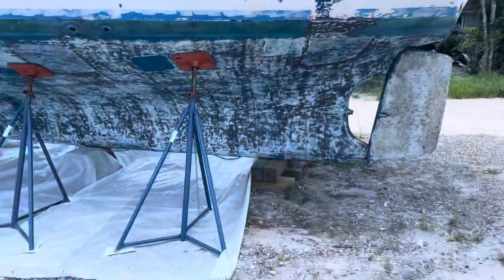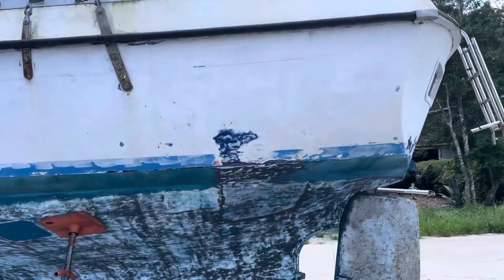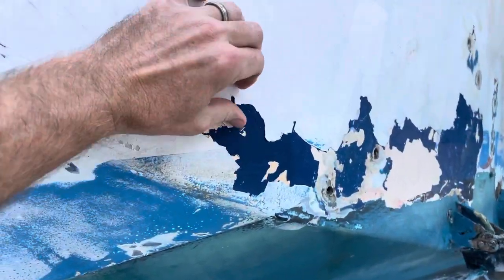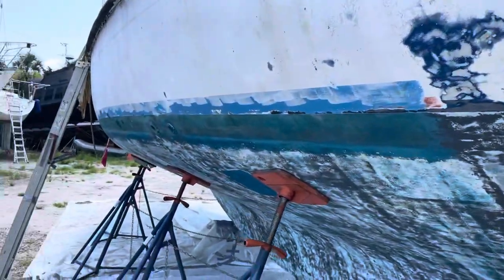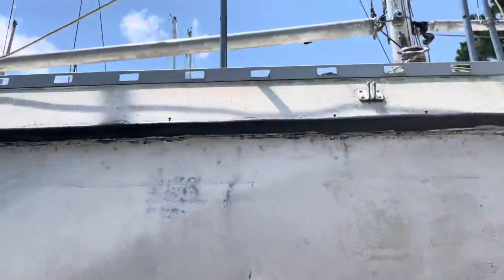As you can see, that upper part is getting ready to be blasted. We started sanding on it and the paint is really, really hard - I don't know what they put on it, but it's very thick and hard. It peels off but you can see how thick it is. We're going to have a gentleman soda blast it. He's going to hit the spots where the pads were and get everything up to and above the rub rail to the toe rail.